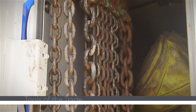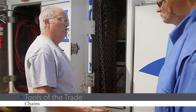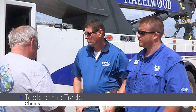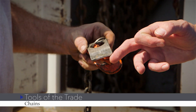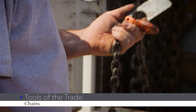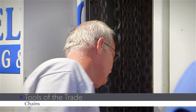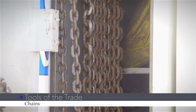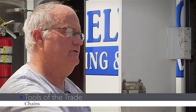All chains are stamped — each link will have a stamp indicating grade eight, grade four, or grade three. We don't normally use anything lower than a grade eight. Our chains are tagged by Vernon Corporation with our company name, the grade, the size, and when they were made. We hang all of our chains up so they're not laying in water and getting rusted — that's the best thing to do. The worst thing is to throw a chain on the floor and let it sit there, where shop water gets on it and it starts to rust. Make sure your chain has a good grab hook, and hook the chain back into itself, not under itself.